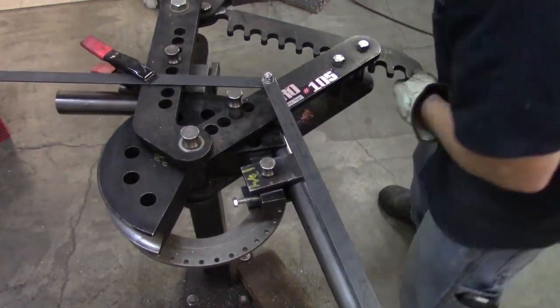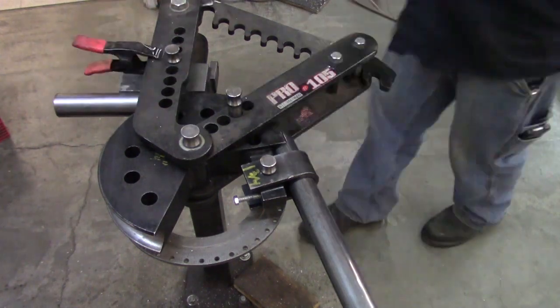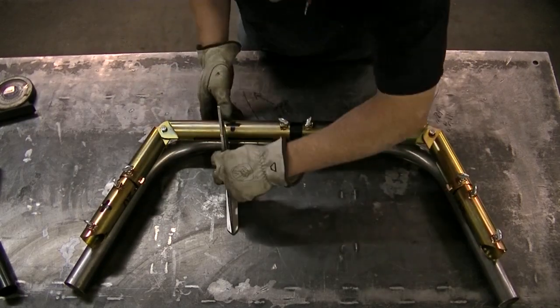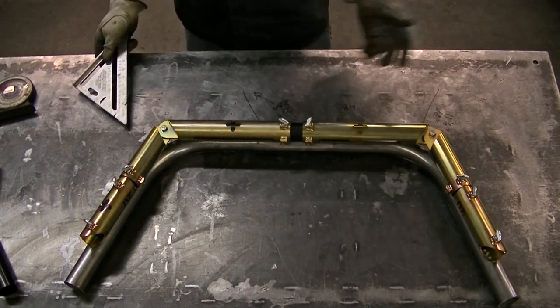When I'm using an angle finder like this, when I relax the machine it actually unsprings back, so I can really verify it's the right angle. Got both bends done. Now I'm going to set the jig back on top, use my square to make sure it's all nice and square—and things are looking good. Everything looks good.